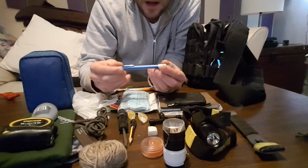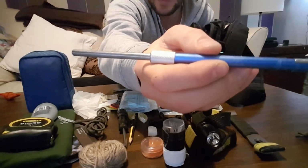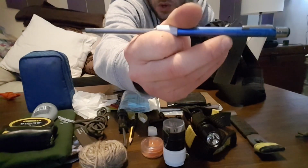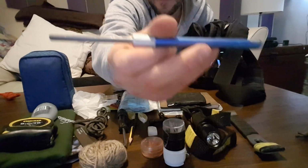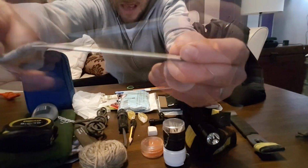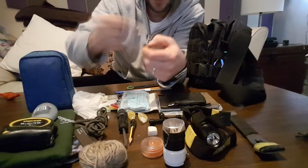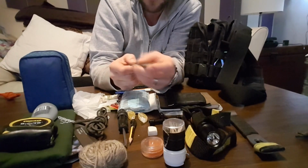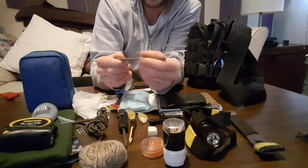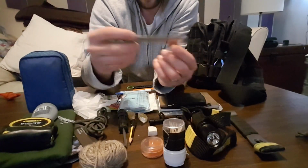I've also got a diamond honing rod, which is good for just putting a very quick edge on a knife. I mean, it's very coarse, and that would be the sort of first stage I would use to put an edge on, like a badly chipped edge on a knife. And then I would move on to this, which is something I doctored. It's one of those chef's diamond steels. It used to have a handle and it was double the size, and you'd hold it and then you'd sharpen your knife, because I used to be a chef. But this is such a fine and nice, I mean, it doesn't even feel like it would do anything, but it's so fine, you can really get a nice edge on your blades with that. It's one step down from honing an edge with a leather strop, I'd say.